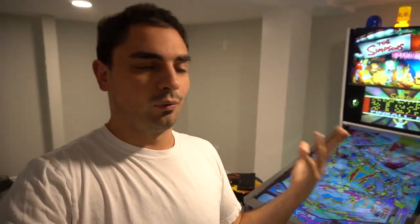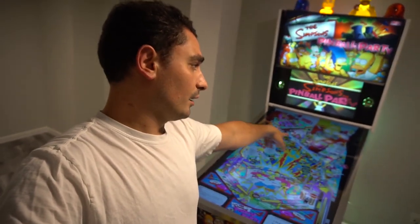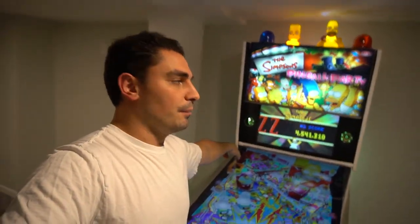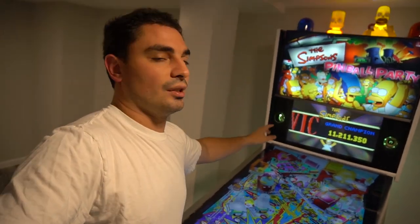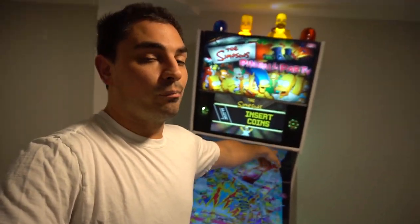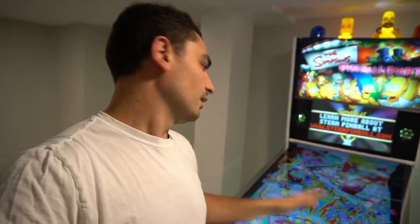As far as my setup, there are four speakers - that's really all you need for surround sound feedback. You have left front, left back, right back, and right front. I used audio cable - four conductor, four wire. I ran one white wire with four wires in it: red and black for front left and back left. Traveling along the cabinet, I used blue and yellow for the right side - blue and yellow for front right and red and black for back right. So all I needed was two white wires, each with four wires inside.